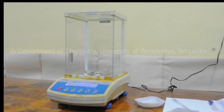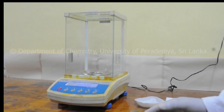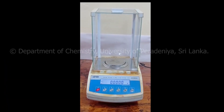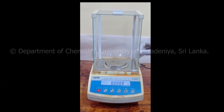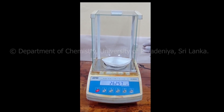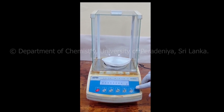Then open the door and get the tare mass of the container. The container is a weighing boat or a small glass container. It's always good to write down the mass of that weighing boat in case you need it later. Now tare the mass of the weighing boat so the balance is set at zero.